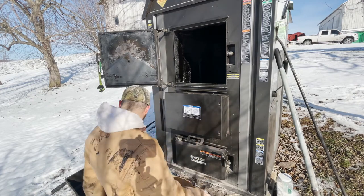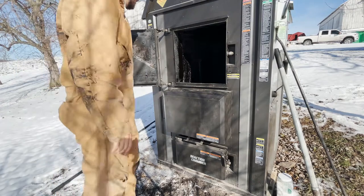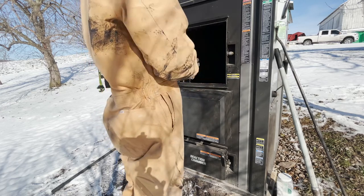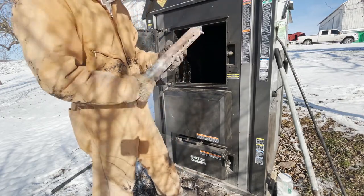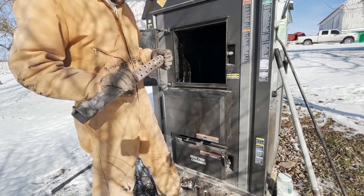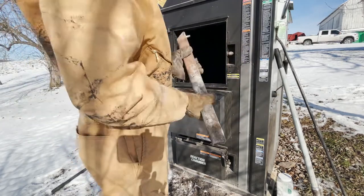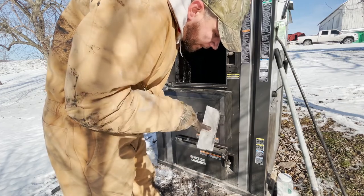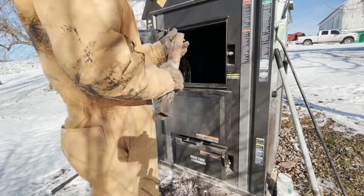These are clean, we know we've maintained good airflow into the furnace, so I'll close that and put the cover back on. I'm going to grab the primary air charge tube - or secondary, whatever you want to call it, the thingamajigger - just to show you. So this is what it looks like; it sits in the furnace and forces air out of these holes to get a more complete combustion. When you clean the furnace you want to make sure there's no obstructions. Be mindful that this thing sits in the middle of the furnace so until it cools down it is very, very hot.